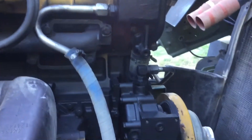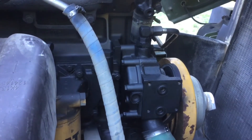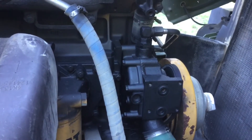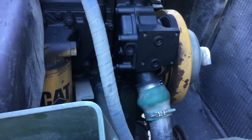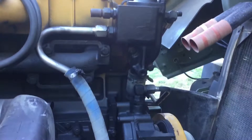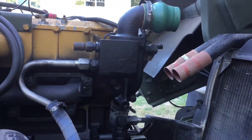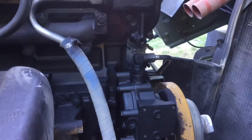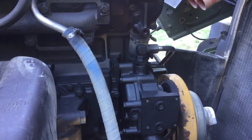I think the reasoning behind diverting coolant down to the transmission cooler was that if you were four-wheeling hard in really cold conditions, you could possibly overheat the transmission because there wouldn't be any flow through the heat exchanger — the thermostat would be closed, or only squirting a little bit out to keep the engine at operating temperature. By putting it back the original way, I think the engine is going to be a whole lot happier.